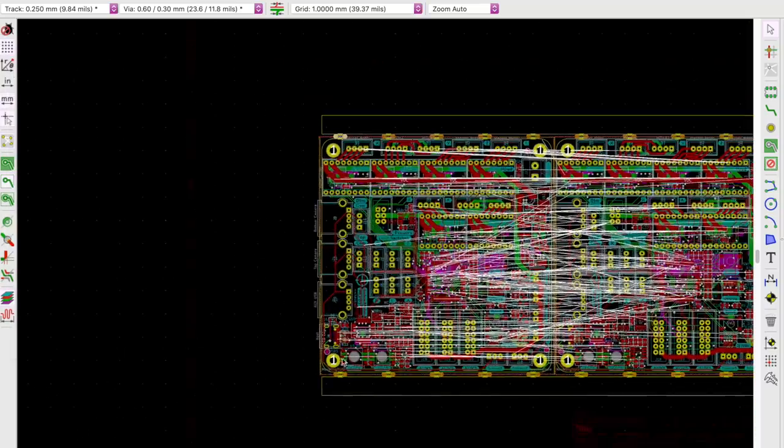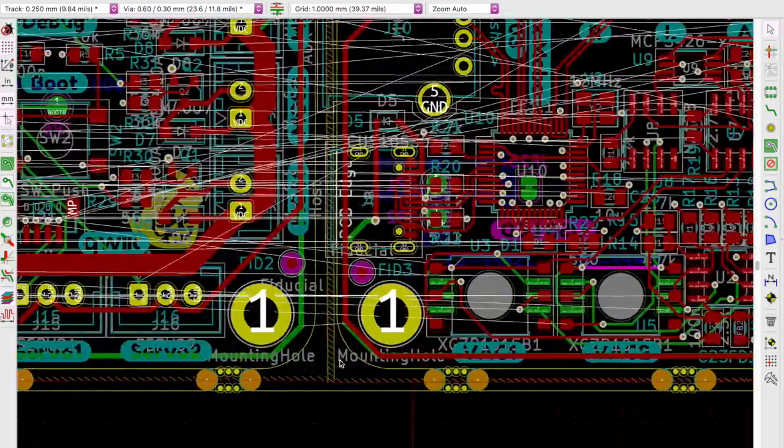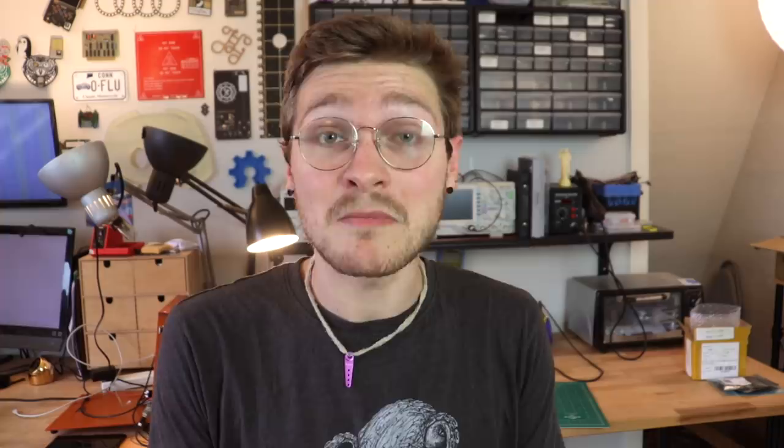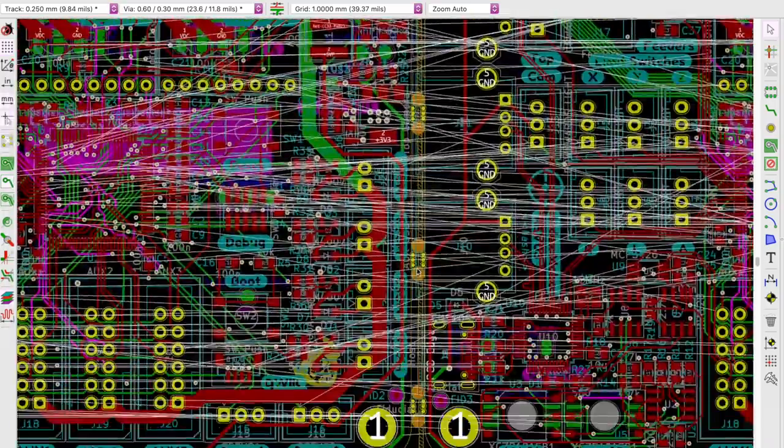I'm going to extend my grid to have a whole bunch of connections along the top rail with both motherboards, and then do another row along the bottom to attach the bottom rail. I found that for a standard 1.6mm thickness PCB, about 20mm spacing between each mouse bite was a pretty good distance — the panel felt pretty strong but wasn't terribly difficult to break away. Then do the exact same thing for the interface between the boards and tile the footprint exactly like last time.